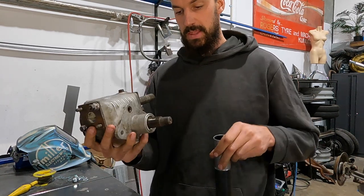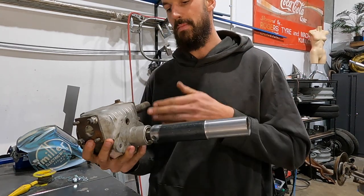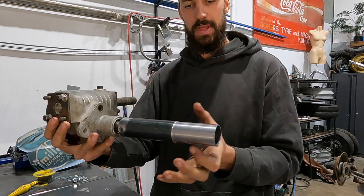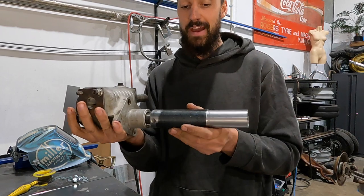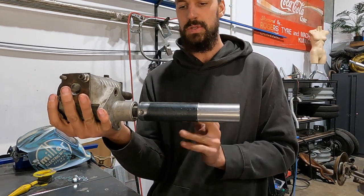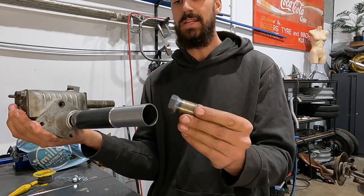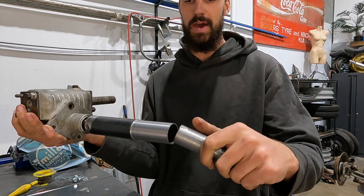So this is what happens. This bolts in. This can be all one unit. I made sure everything was mounted off this side, so this whole unit can come in, slides up to the plate. This slides through the pillow block. The pillow block, by fluke, literally the flange touches this, which is awesome. So even if this were to fall out, which it won't happen, it's unlikely, but in the case that it did fall out, it can't go anywhere because it's going to be stopped by this.